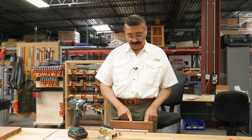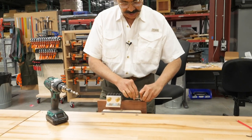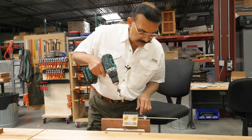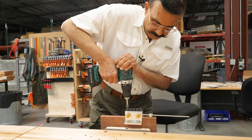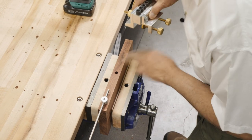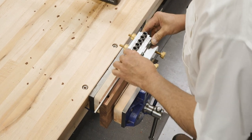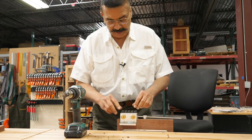So I'm going to be drilling three holes into this. I've already drilled the first hole — the pilot hole — which was done setting it here. Now I've got this jig set up where I'm going to stop this and drill it in the middle, and then I'll go over and do my last hole over here. So that's all set up. Everything's touching. It's good.